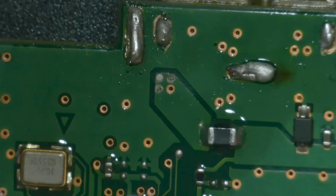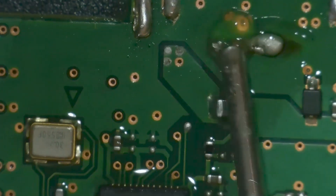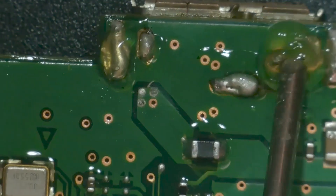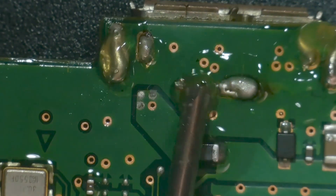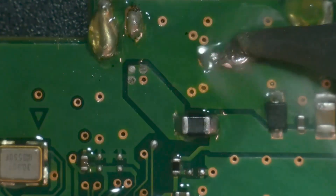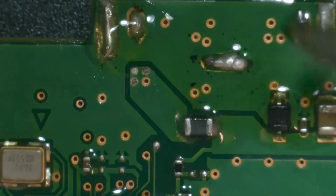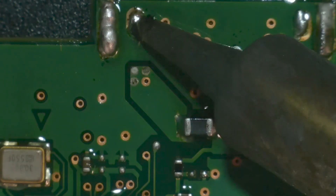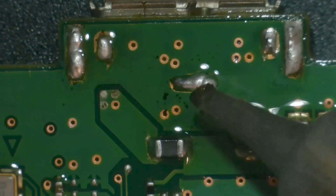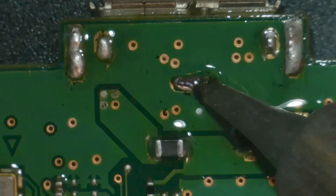First I decided to re-touch those big joints, but the solder wouldn't flow very well — it was very blobby — so I decided to grab some flux. Here's an example of the board moving out of the way because I kept wanting to look at my hands with the soldering iron. I applied some heat and it's not too bad, though a lot of the joints are dull. Typically I expect them to shine, and you can see as soon as I take away the heat it gets dull. I cleaned them up a bit and I'm pretty happy with that.